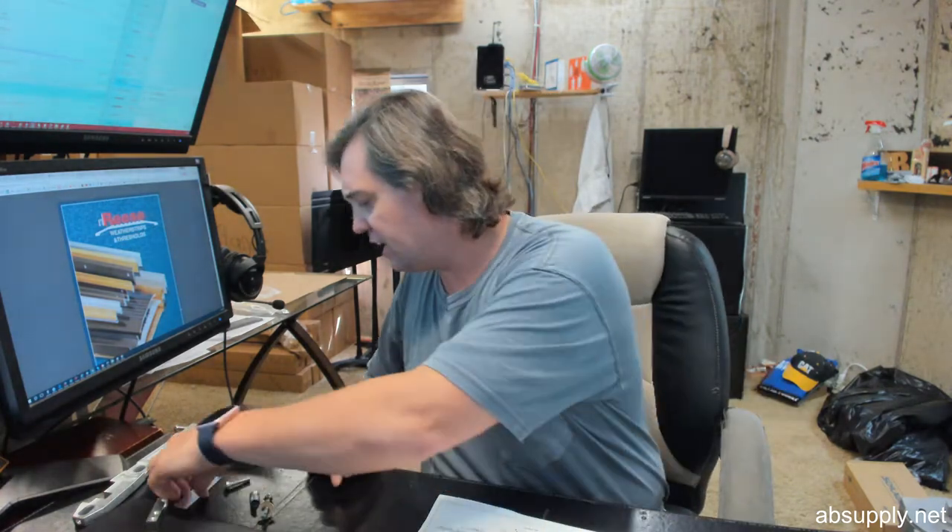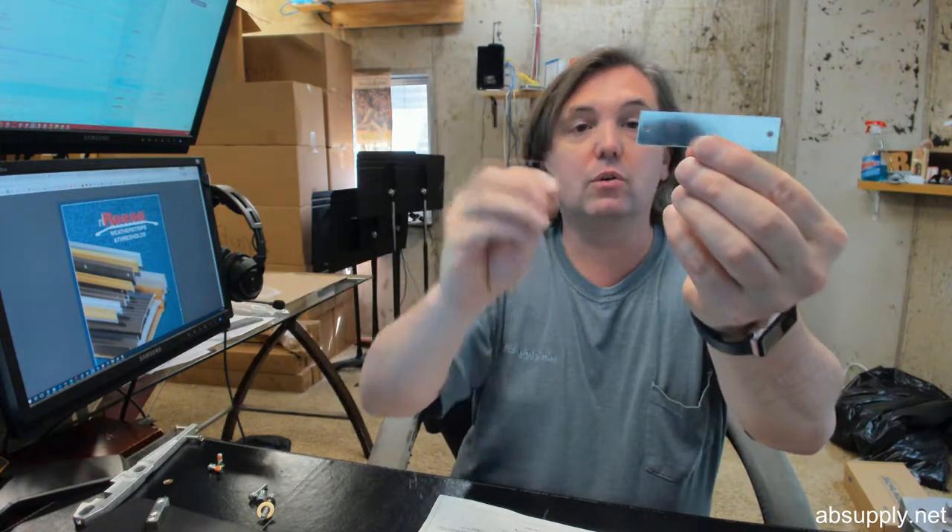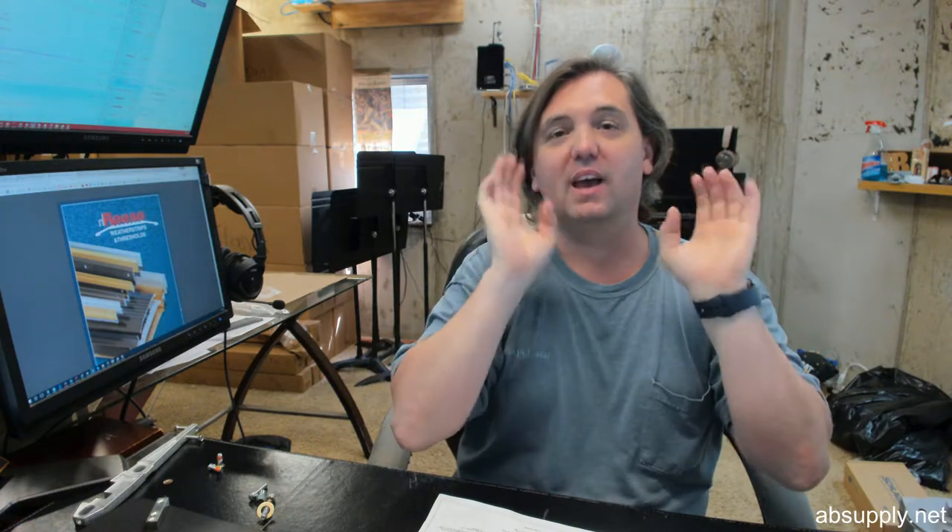Because you are notching the face of the door for a side load arm, you will get a plate and a couple of tiny machine screws. You will notch the door on the inside — you don't want someone with a tiny screwdriver to remove the plate, access the three bolts, and tip the door inward. Put that notch on the inside of the opening.